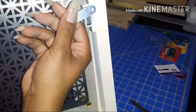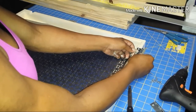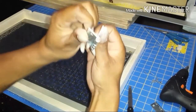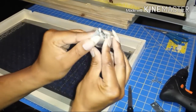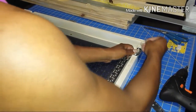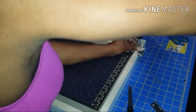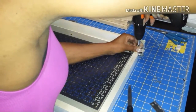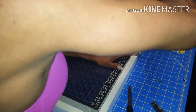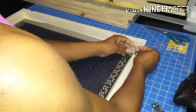Try to find a magnet that is heavy-duty or rated for high-traffic use. When it comes to applying the hinges, make sure you get a hinge that's not too big or too small for your project — otherwise it could rip right out of the wall. When applying them, make sure the hinge closes properly and apply the hinge to your frame on the side. I'm putting the hinges closest to the corner of the wall where they won't be seen by guests. When attaching your hinges, drill the first screw only halfway through, make any adjustment if it's off, then drill the second screw all the way through, and then go back and drill the first one all the way through. Repeat on the second hinge.